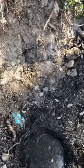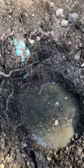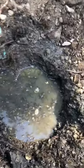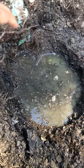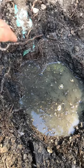That's the dissolved concrete right there. This tells us that it's very important to leave your distribution box with enough air circulation. The cover has to be up on the surface to allow air circulation in here — otherwise the gases from the septic tank and from the effluent traveling into the distribution box stay trapped and start to disintegrate the concrete.